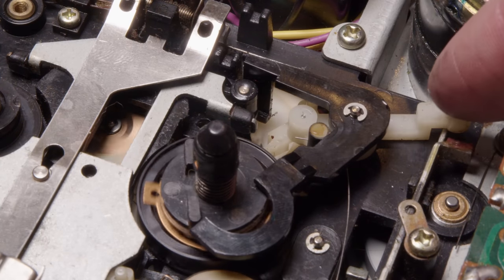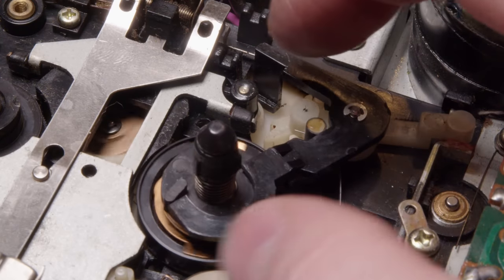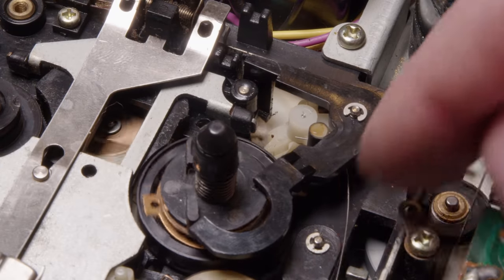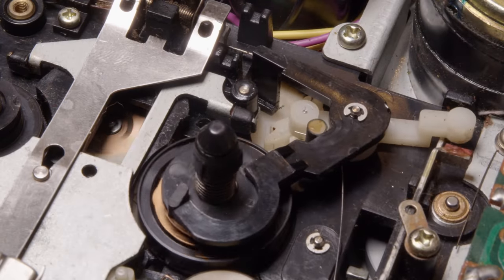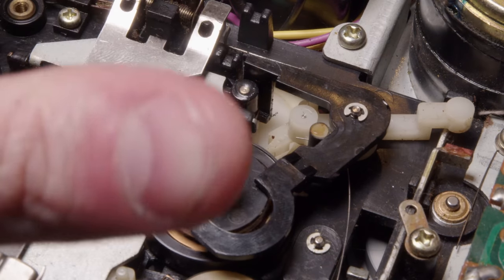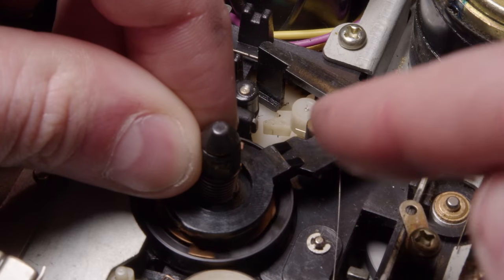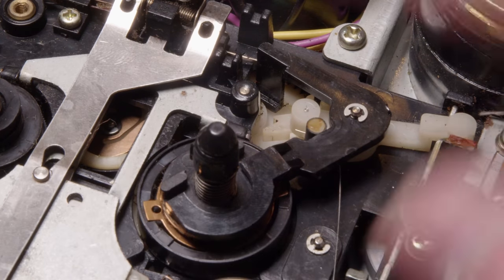Now, it is also simultaneously tied to this white piece of plastic, and you can see there's a matching nub right there. But every time this rotates, because it's getting pushed out of the way by this nub, it's dodging that nub, and it's instead hitting this one. Now, this is directly linked to the stop on the piano keys. So as soon as this gets plunged, it'll stop and it turns it off. And so what happens when I hold this is that this nub will stop spinning, which will cause this to stop turning back, and it will cause this to catch on it, which will then push this all the way and stop it. It's really bizarre. So you can see it pushed it out of the way, it wasn't able to reset, and this time it catches, turns it off. Wild. It seems so complicated of a way to do this. I can't even conceive of how you would come up with this system.